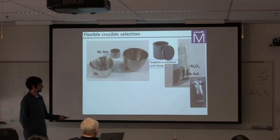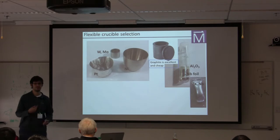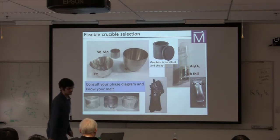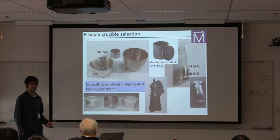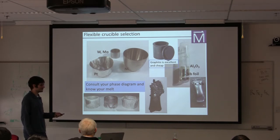You're not limited to metallic crucibles — you can also use oxide crucibles like aluminum oxide. Aluminum oxide doesn't couple to the RF field, so you just wrap a susceptor around the crucible. I've used things like niobium foil that's very thin — niobium thin plate is really good because you can bend it and get it to grab itself. Tantalum and niobium crucibles are also very friendly for this technique, partly because they're good refractory metals but also because you can seal them using an arc furnace, allowing you to put elements in that might have a high vapor pressure.